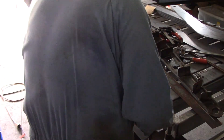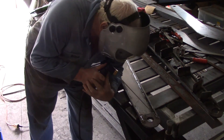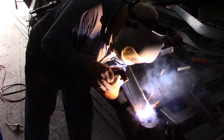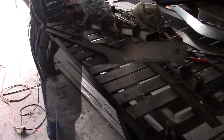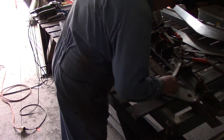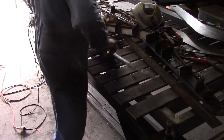Knock the flux off and I'll put a weld across the end. It's a fast weld across the end because I'm welding quarter inch plate to three millimeter plate — don't want to burn the bottom end. And that should do it. Just enough heat to bubble the mill scale. That should be alright — couldn't have gotten less heat through it anyway.